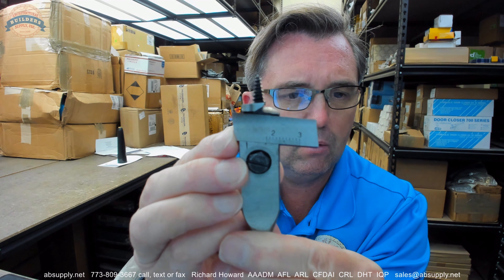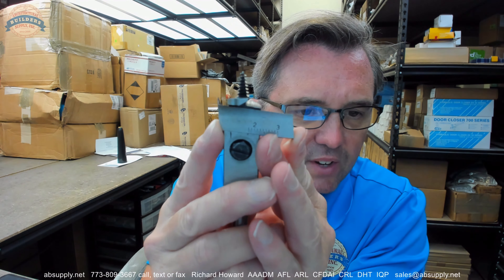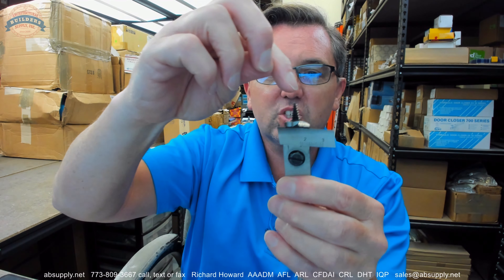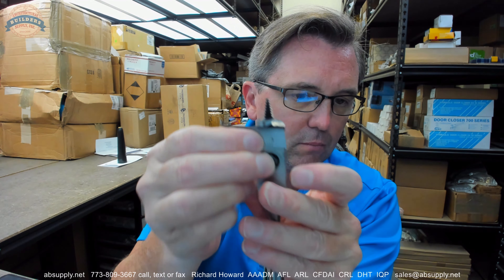It will allow you to move that around. You can see the hash line there — 7 eighths would be at the minimum. What I'm trying to illustrate is that from the center of the self-feeding bit to the scoring cutter, it's 7 sixteenths of an inch that would give you your 7 eighths minimum. Sliding that out, it's going to allow you to set that on your line — this was probably set at 2 and 1/8 inch.